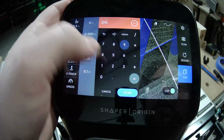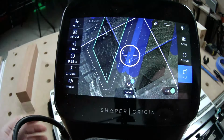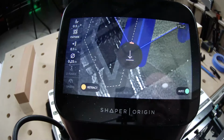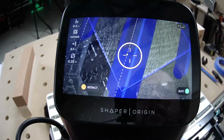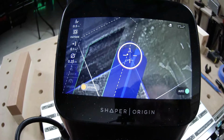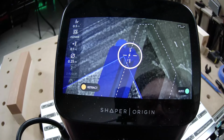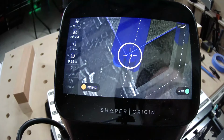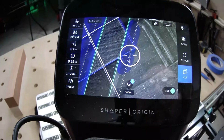Now, are we going down in depth here, Jake, or are we going down in offset? Looks like we're going down, yep, to 0.5-inch depth. And we're doing this in 1/4-inch steps at a time here. It's because we've got this 1/4-inch bit. We're not trying to go too hard on it. Nice. Last depth, cleaning that up. We've got a small offset here that's going to allow these roughing cuts to be a little bit heavier. Then we'll come back and just clean those up at the end.